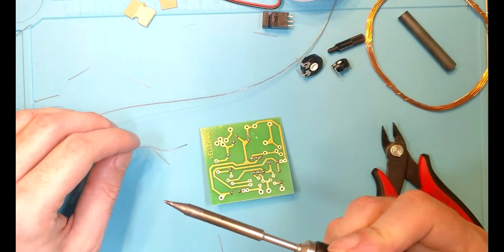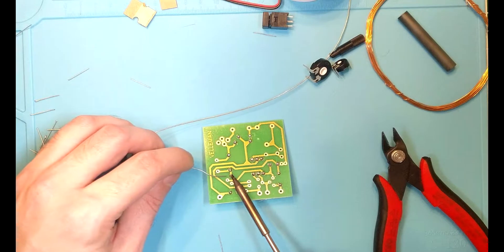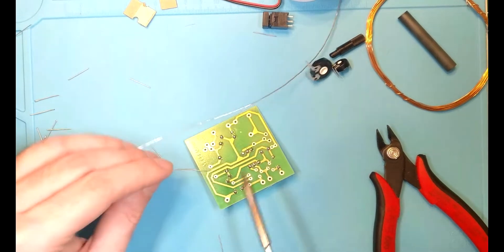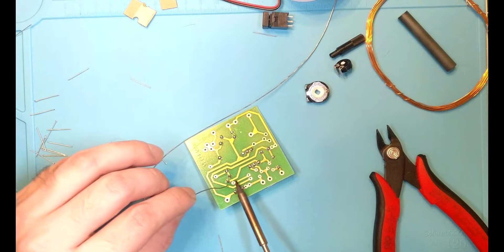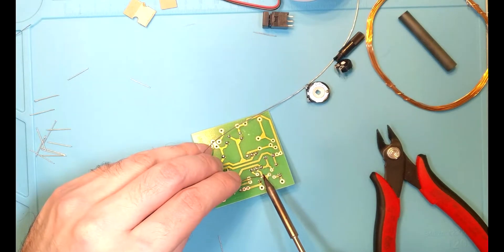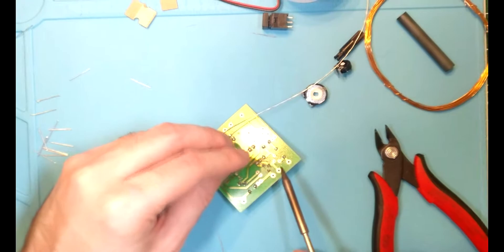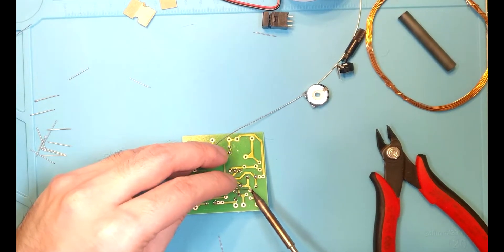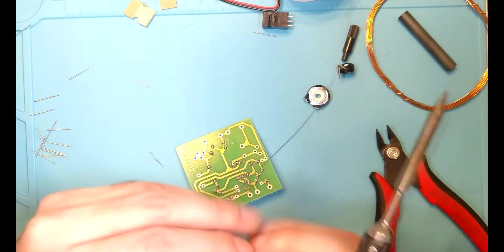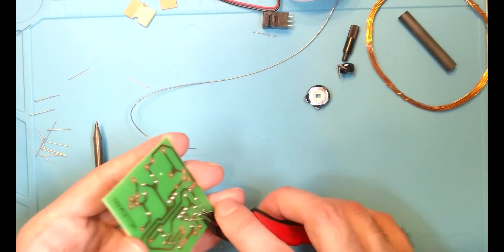I'll have to change the sleep modes on it. I'll wait for it to come back up to temperature — it's a very fast heating soldering iron. It doesn't have a lot of thermal mass, which can make soldering onto a ground plane a little challenging. But the heater core is right up in the tip, so it heats very fast. Hopefully once funds permit, I'll order the style of tip I actually like — I much prefer round chisels over conical tips. They're really nice for soldering onto ground planes because you can get a lot of surface area of the iron onto the pad. Anyway, let's crop those leads off now.